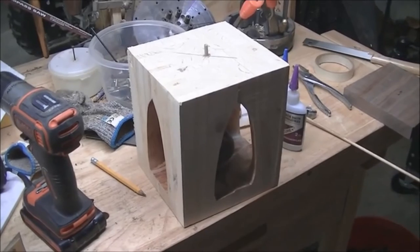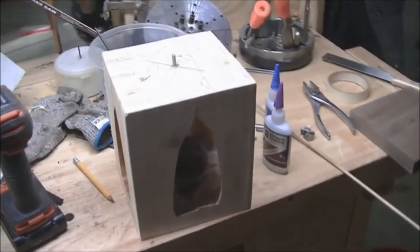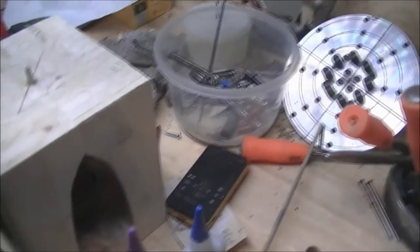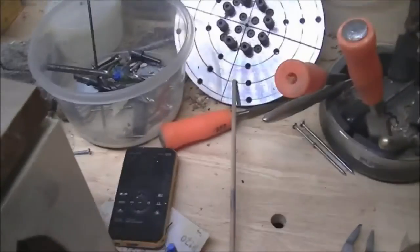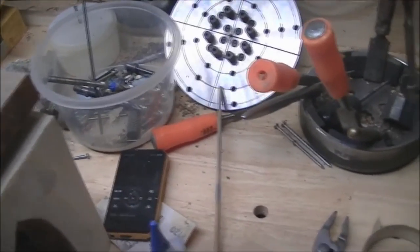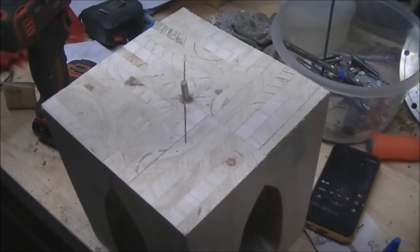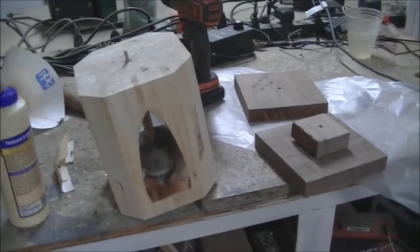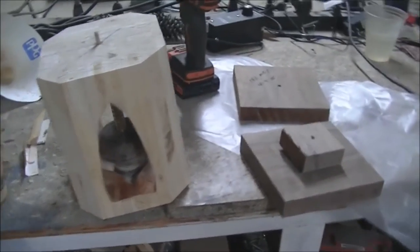I got it out of the clamps and I've squared it up on the sander and the bandsaw, so I've got all nice square edges — it's just a hair out of square. Here's a little trick I use that helps me a lot, especially when I know I'm going to be turning the center out: this piece of walnut is going to be my base, and I find the center, drill a hole, and put in an eighth-inch dowel pin. I also drill a hole in the mating piece, so I'll always find my center when I glue it — no slipping, no sliding. I'm going to 45 all these corners off to make it round before I put this on.